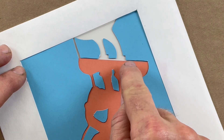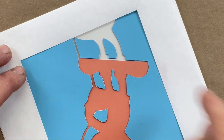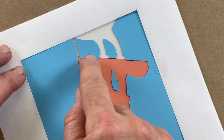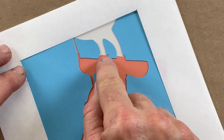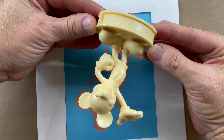If I oriented the piece straight up and down — flat — you could trap a bubble anywhere along the bottoms of those feet very easily, because there's nothing pushing the air out. That's why you tilt it: to position it so that you push the air out. Position in the mold is so important — you always want to tilt the thing so that everything is flowing uphill and all the air is flowing uphill. That is why it is so important to position the piece in space correctly.